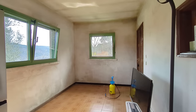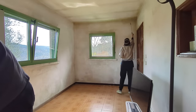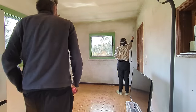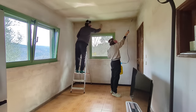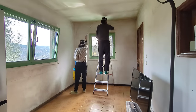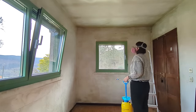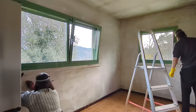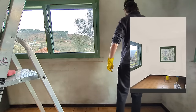Back inside the house, we started to prep another room for painting. A combination of colder temperatures during the winter and increased indoor humidity eventually led to mold growing in some areas of the house. This was likely made worse by the installation of our new airtight windows. Ventilation is key, and I'll be addressing this problem before next winter. The external insulation we plan on having installed will also help prevent mold growth too.